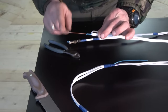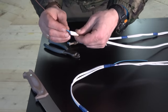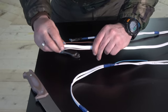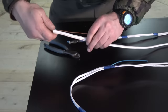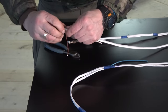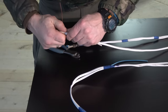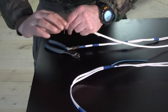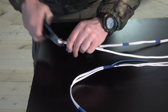For this, don't use braided wire — just use what you can see here, solid core wire. We take this wire, bend it down like this. Can you see that? So now we have the insulated parts on one side, the non-insulated part on the other side. We take this wire, bend it over like that, and then we make a few windings. Four is enough. This is a two square millimeter cable. We make one, two, three, kind of like four windings. We shouldn't make much more than that.